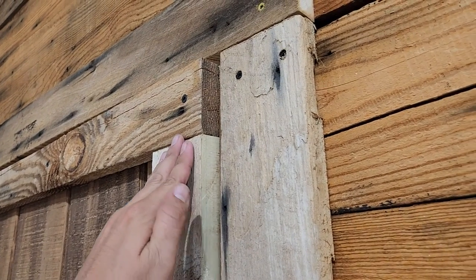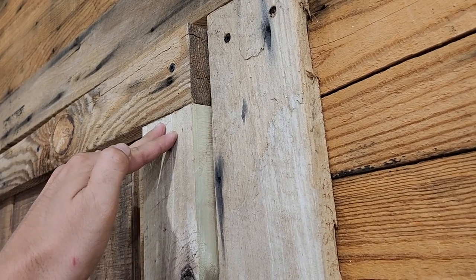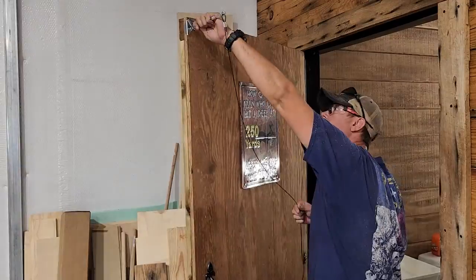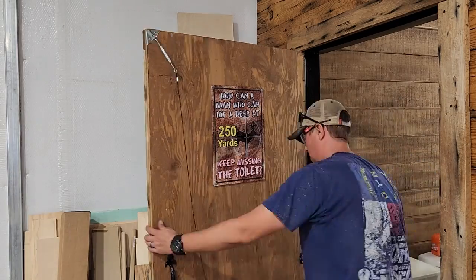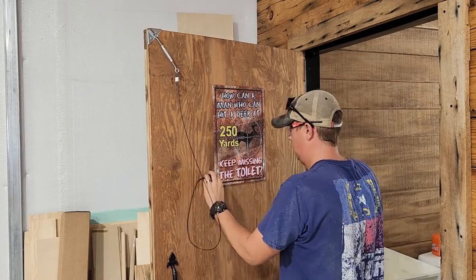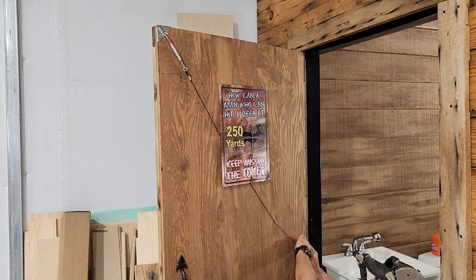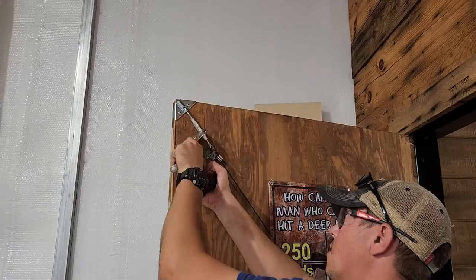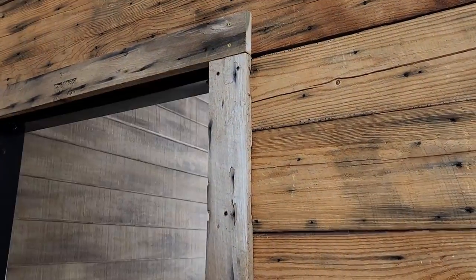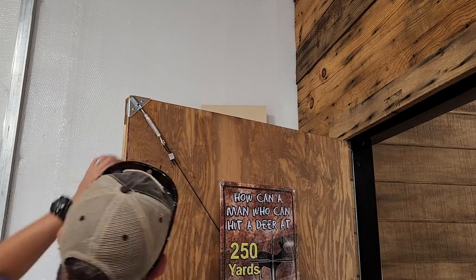Because of the nature of the types of wood I'm using, I can't expect this door to hang perfectly. If you look at the top right corner it does stick out a little from the door frame, but I'll show you how to fix that. You can pick up one of these kits meant for fixing sagging gates — it incorporates a metal cable and a turnbuckle. Mount one end of the cable to the lower portion of the hinge side of the door, run it up to the top corner that's poking out, and when you tighten that turnbuckle it pulls that top corner in to close the gap.